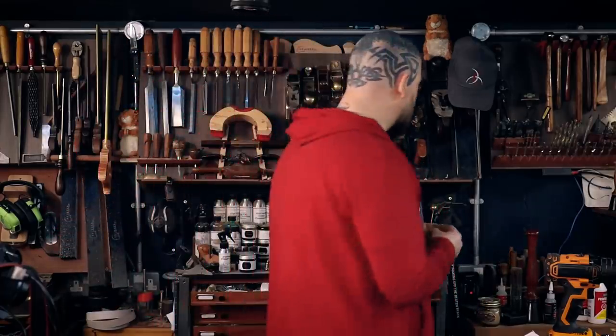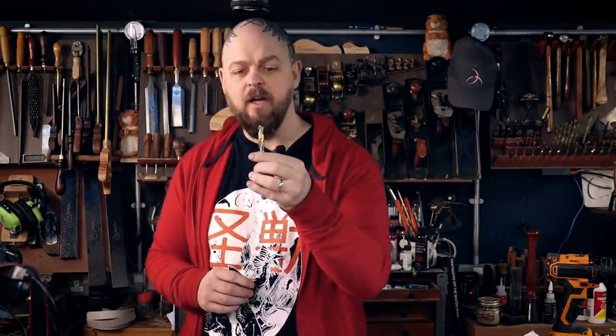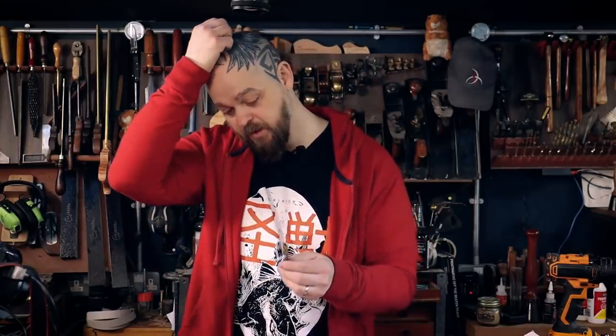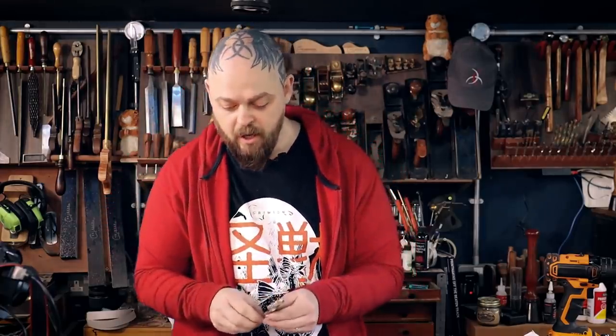As my intelligence level drops, it means I'm closer to needing food. So there we're at. What I'm worried about is using a 10 millimeter twist drill, and as it pulls through the top layer of the aluminium, I'm worried that it's going to grab the aluminium and spiral out of control. Now, a twist bit is designed for metal in general, and I do think that it will work.